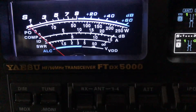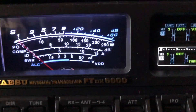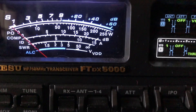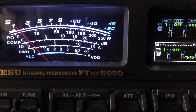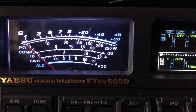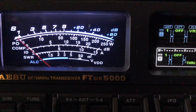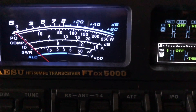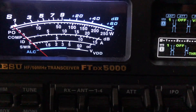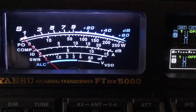Now let's see what difference antennas make. We're listening to him on a ZS-6 BKW multi-band dipole. Switching to the doublet now — the doublet's going to bring in a little more noise because it's got some gain here; major lobe on 20 meters headed out west. You hear better with the ZS-6 BKW. It does typically have a better noise floor, but not as much gain either. I've got the better signal-to-noise ratio on the ZS-6 BKW.